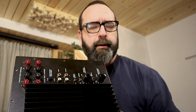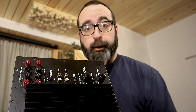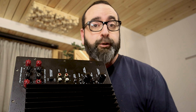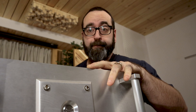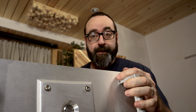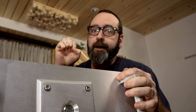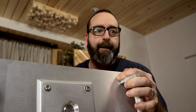Next, using push-pull amplifiers — whether Class A/B like this one, or a larger push-pull amp going up to 300 watts — the results for home use were much better. The control of the driver using both coils was significantly improved with the push-pull amplifier.